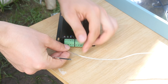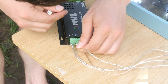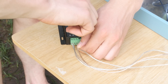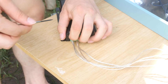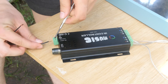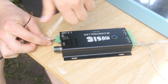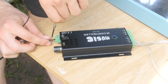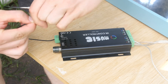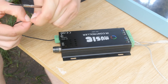I've picked up this RGB music controller, which gives me a lot of functions with the RGB LED lights. You don't necessarily have to use one of these — you can just hook it up to a 12-volt power supply, or even wire it up to a Molex connection and use it in your PC, since Molex is 12 volts and these LEDs are rated for up to 12 volts. I'm wiring up a 12-volt power supply to this and plugging it into the power socket. If you want this in your PC, Molex is the easier option since you won't need another power outlet.